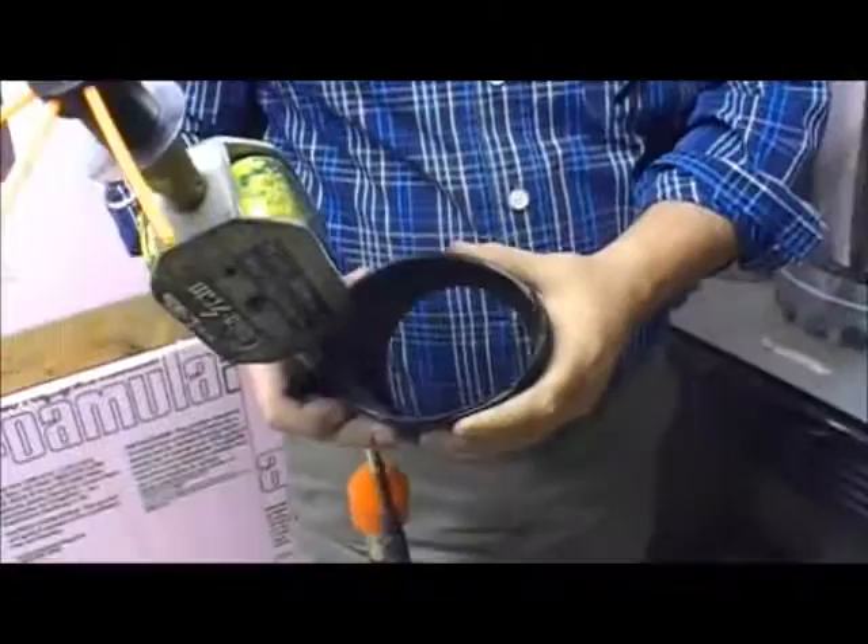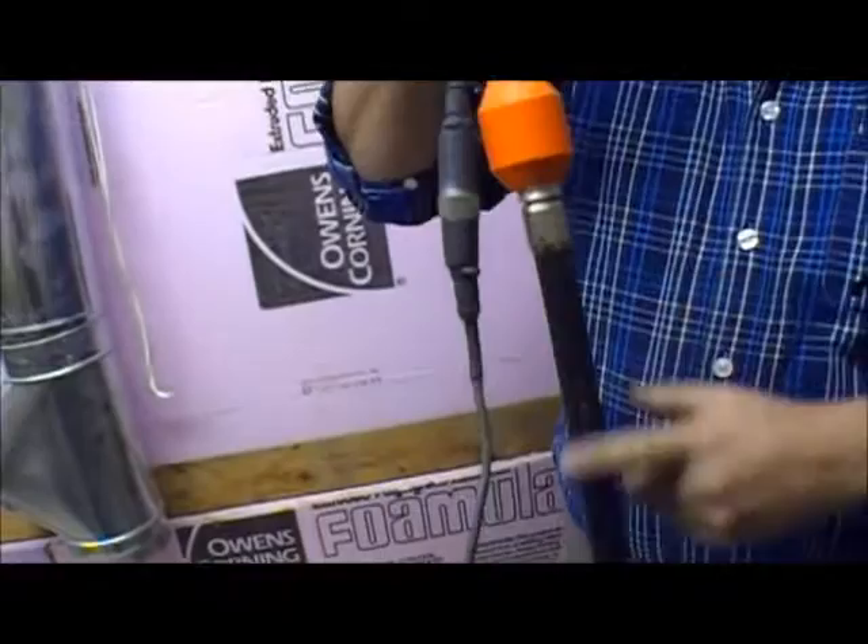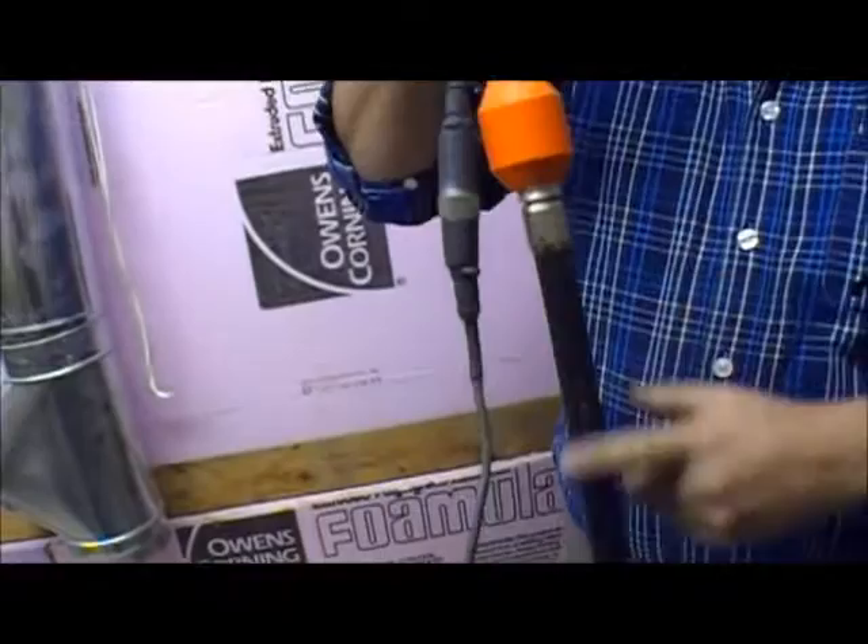This one pops right out, hardly even breaking a sweat. And because it's so flexible I don't have to worry about deforming anybody's damper — I can slick it in here and get it right through. This thing popped in and out without a problem, really easy. That's how we deal with thimble chimneys now. You can go through with the bracket as long as you have this flexible piece on there. Chuck, just make sure the guys are supplied with a half-inch rod so there's a little more flexibility to turn the camera. That's it — best of luck and take care.